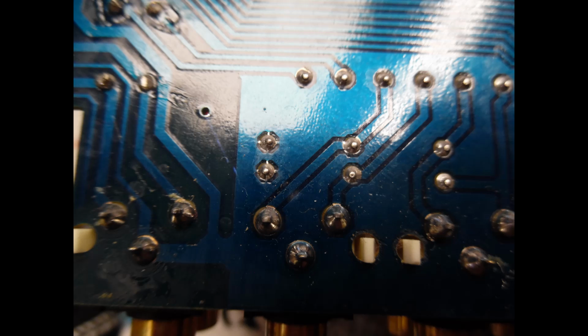So what you have to do is desolder the connection, but as I've said many times, don't just flow some solder over there. It's not going to be mechanically strong enough. So use some link wire, wrap it around the terminal as it comes through, and then connect it onto the board. You just have to scrape a little bit of the coating off to expose the copper of the circuit track, and then flow that link onto there, and that will provide you with a very, very strong mechanical contact. So that was done first, and again it was retested, but the issue still remained.